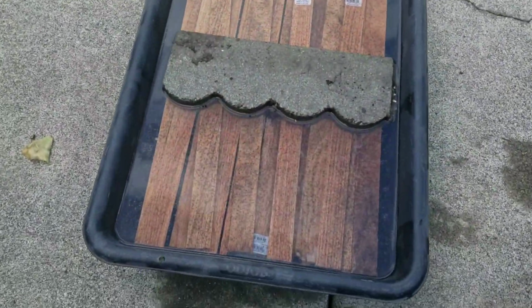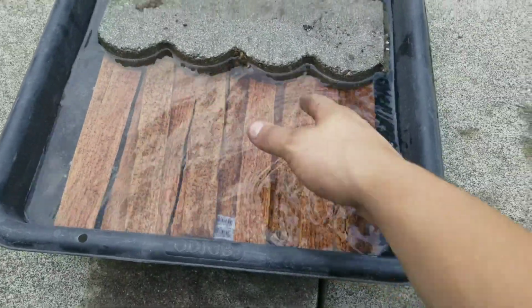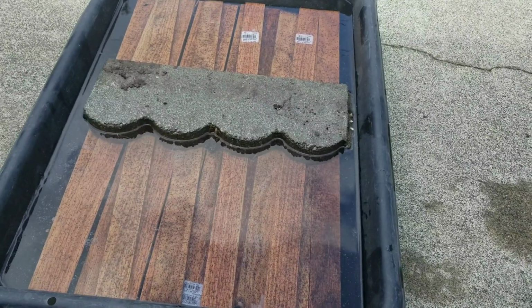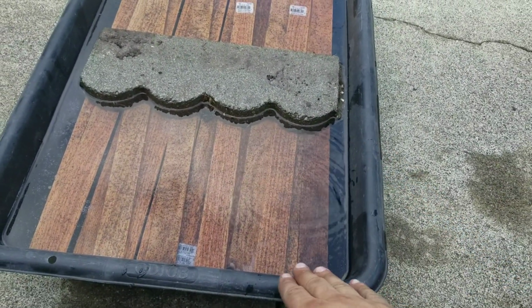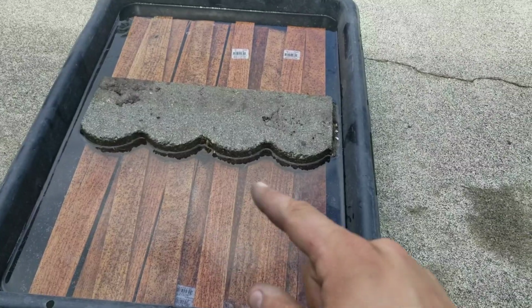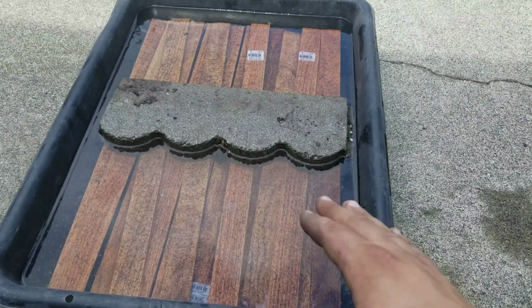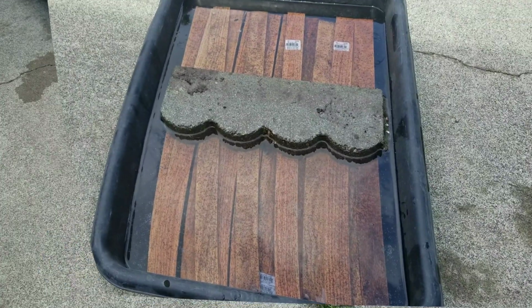And now the wood's been soaking for about an hour or so. It's kind of gotten a little mucky from the concrete block, but we're gonna yank it out of here, and then I'll start finding its natural curve, because it has it, just the wood grain itself has a little bit of a curve from it drying previously. And then we'll make sure that it dries kind of to where we need it at, and then we'll leave it further out here in the sun so that it can dry out as much as it can with the curve that I need for the rack itself.